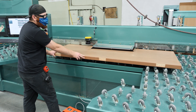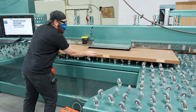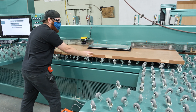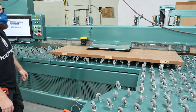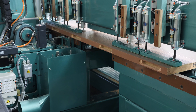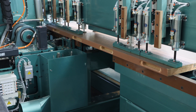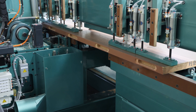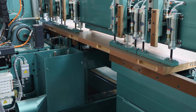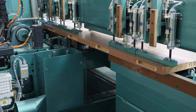We'll extend the doorstop with the foot pedal, bring the door over up against the stops, and clamp the door. Now we're ready to start the sequence. We will start the sequence and demonstrate how the head comes down and measures the length and thickness of the door to verify that the dimensions that were downloaded match the physical door that has been loaded into the machine.